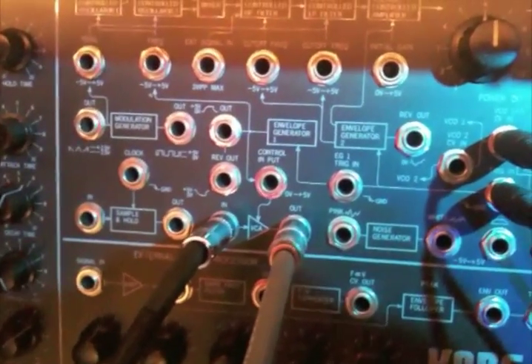And that's it. That's about what the circuit's going to end up being. It's going to be pretty much a straight duplication. The mini circuit boards I'm trying to put together are aimed at being very cost effective. Basically all of them will have one board-mounted pot and maybe one or two off-board pots. The idea being that any format — whether you're Euro, 5U, whatever you've got going — you can pretty much pop this board into any module that you want to modify.